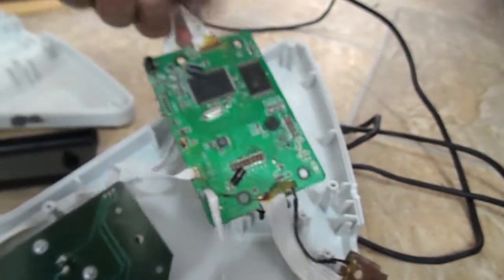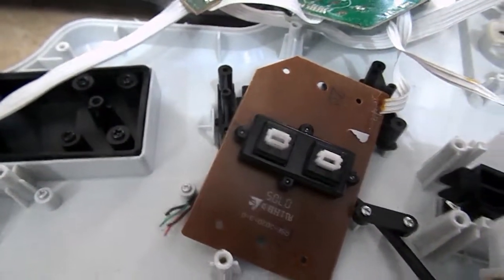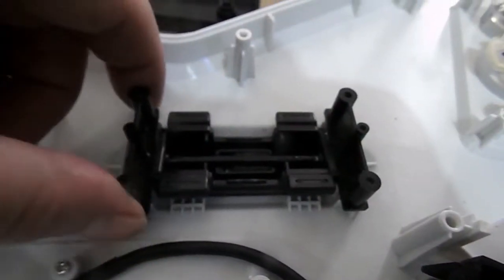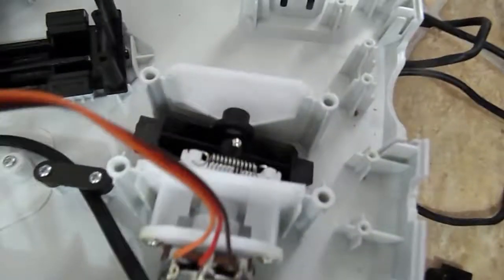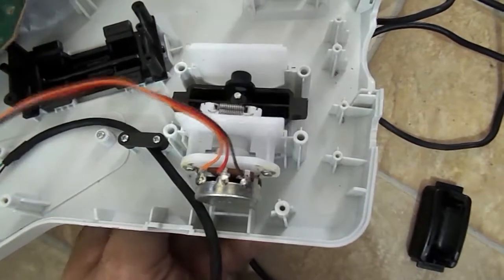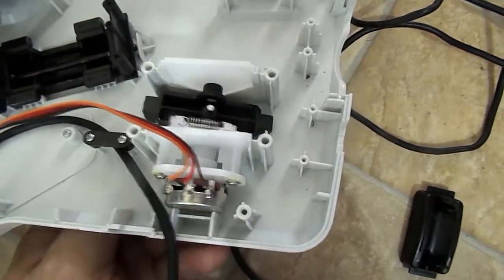In this guitar, the brains are on the control board underneath the control panel. It's a really high-quality board, but way too complicated for me to hack. The PCB under the strumming pad has those Cherry MX style high-quality switches, and the PCB is simple enough to hack and reuse — score! The whammy bar is a lot like the previous one, spring tension potentiometer, but this one uses all three connections, so there's no need to add a third line to connect it directly to an Arduino.